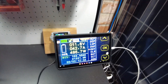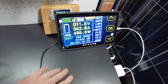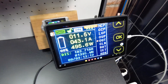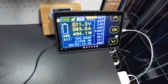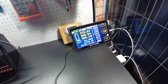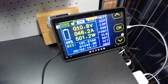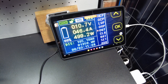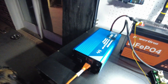We're still going — 103.45 amp-hours, 1,332 watt-hours. Still going, we're definitely going to get to 104. We're going to go past 104 because we're still at 11.5 volts — well, 11.4 now. Look at that — 104 amp-hours, still going. We might get to 105. We're about to hit 105. The inverter's complaining but we're gonna keep going — 105, 1,350 watt-hours. Inverter shut off.